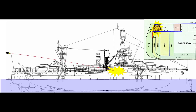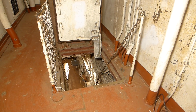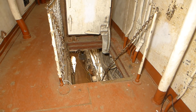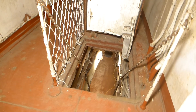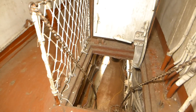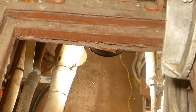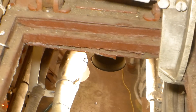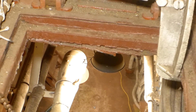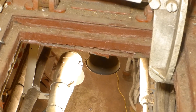Let's look at one portion where we can see the deck armor in cross-section. The thicknesses varied on different parts of the ship, but here at this major deck hatch going down to the third deck we can see three distinct layers. The first thin lower layer is simply mild plate steel used as the base. Above that is one-and-a-half inches of STS armor — the original deck armor for the second deck. Above that is an additional layer of inch-and-a-half thick STS armor, giving a total of three inches of armor altogether.